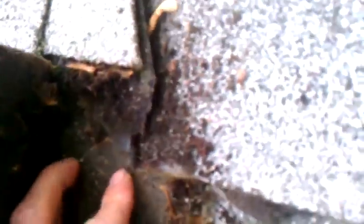If you can see down in there, there's actually a hole for water to get in and underneath this valley. Basically, what they tried to do was they tried to caulk it. But you can't caulk that because it's just going to open back up. If you want to caulk it, you've got to caulk underneath as well. Because the caulk isn't even working - you've got it on top, but the water has already ran under the shingle and now it's underneath, so the caulking's doing no good because it's on top and the water's already under.